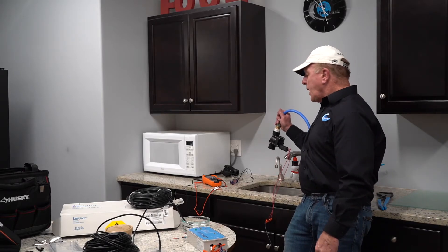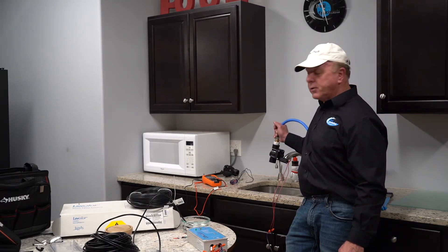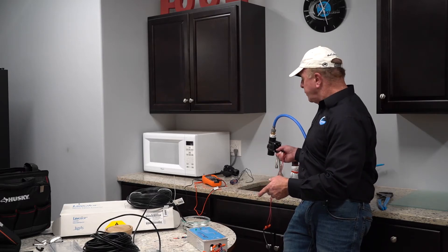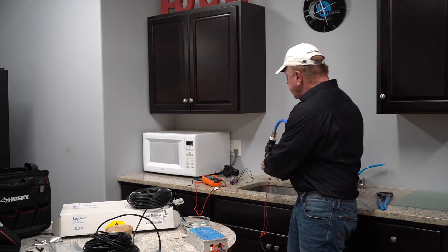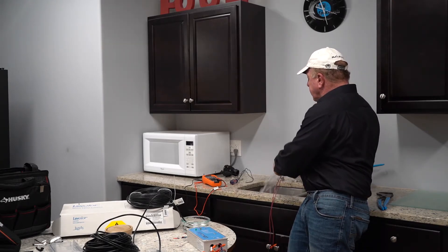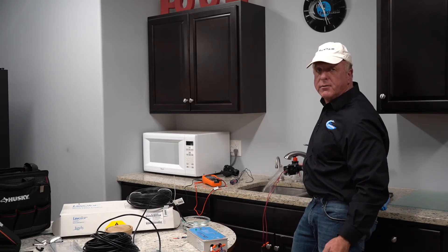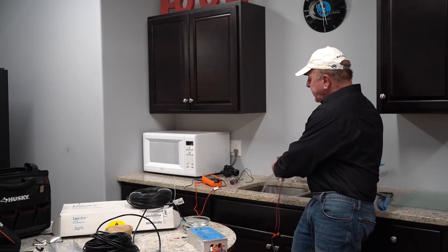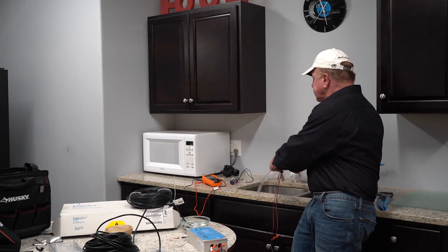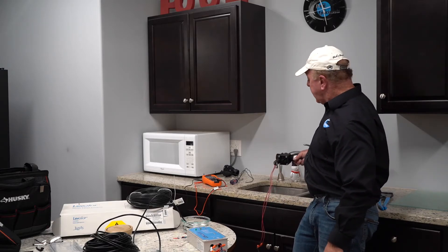This is our fill valve. I would highly recommend that you test the fill valve before you install it — it has a high failure rate, sometimes with the solenoid and sometimes issues with the valve itself. One thing I noted earlier is that you can turn the solenoid counter-clockwise about a quarter turn and the water will turn on. This is convenient if you need to fill the pool while vacuuming or backwashing, however you need to put your truck keys on the solenoid so you cannot drive away and leave the fill on. To shut it off, simply turn it clockwise and tighten it up.